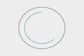A second barrel is now used to construct the inner skirt. Center the pot upside down on top of the second 200-liter barrel and draw a line around the pot. Now, center the combustion chamber upside down on the barrel and draw an outline.